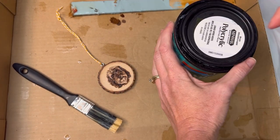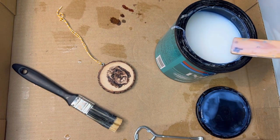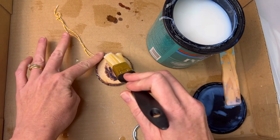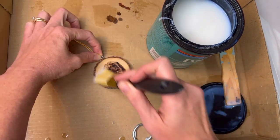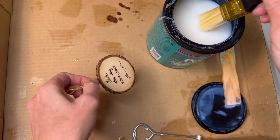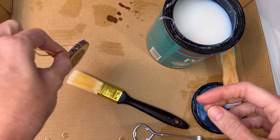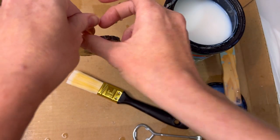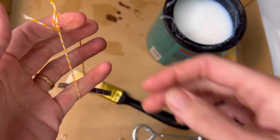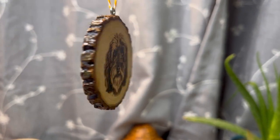Here I am using a polycrylic to finish this piece — there are lots of good options out there, but this one just doesn't yellow over time, so I really like this finish. You probably noticed I already added the hanging hardware. Sometimes I do that because it makes finishing easier — if the hanging hardware is already attached on a small piece, I can seal the front, back, and sides and then hang it to dry instead of laying it flat. For a larger piece I can add a sawtooth hanger or d-rings with wire depending on how large and heavy the piece is. Once you've added the hanging hardware and the sealant, it's time to let it dry.